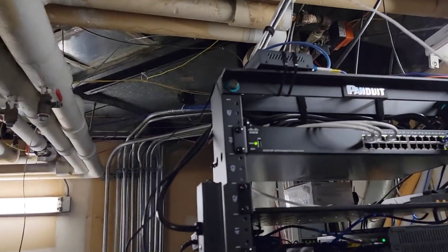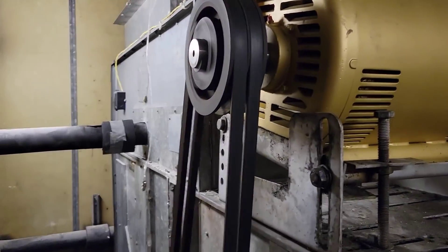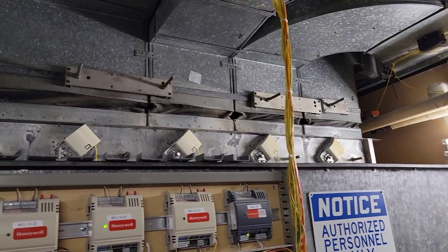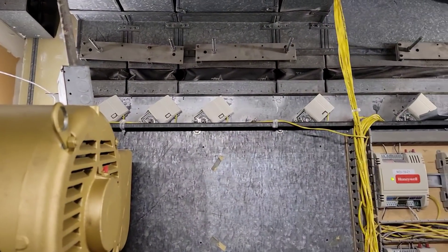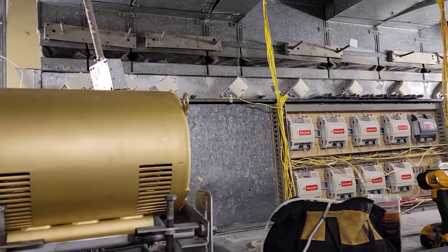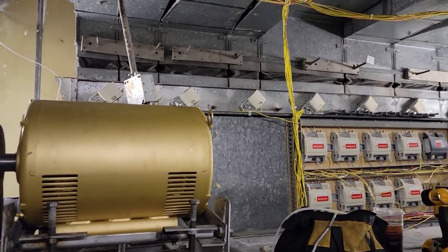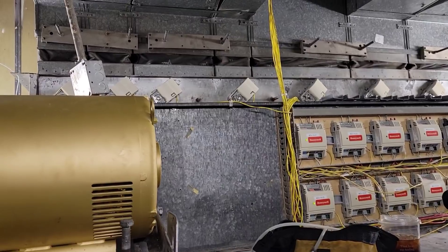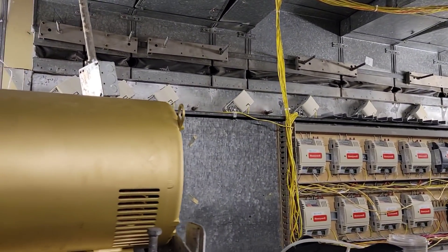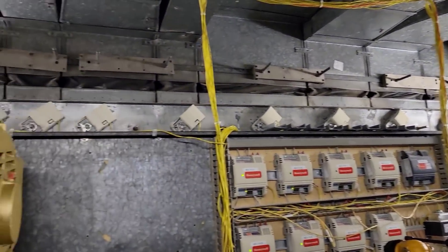This is an open air return, so I can't calibrate here. It's a multi-zone system — each one goes to a different zone in the space. That static reading I'll take at each zone will help me determine: if we're not maintaining much static on the supply, we have too much air open downstream and may be over-feeding. On the flip side, if we're high on static inside at the supply, we may be restricted and have capacity to open up some dampers downstream.